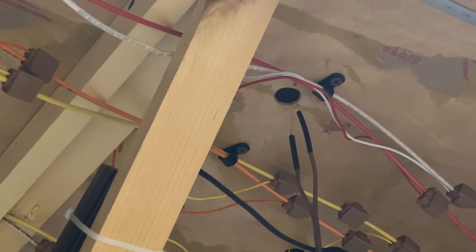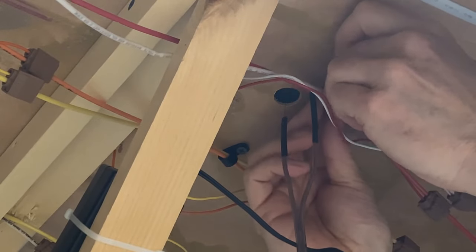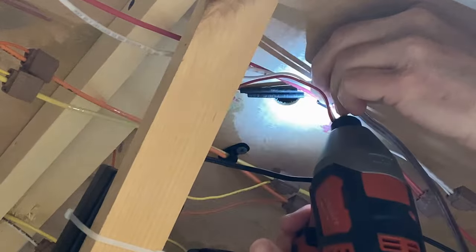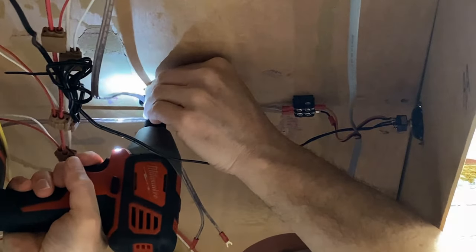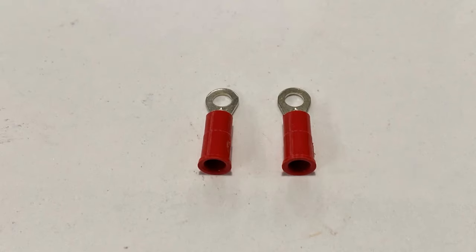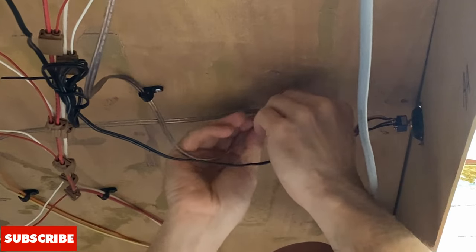For those people like myself who wouldn't know — the shrink tubing is just a cheap and easy method of insulating the wires that we're going to be attaching to the signal. One piece slides over the resistor and the second slides over the other wire that's going to feed the signal. We then attached the hanging wires to the layout using a clip to minimize the tension on the wire joints. Moving to the other end, we attached lug rings to the end of the wires so that they could easily be attached to the terminal block we were already using for the Tortoise control itself. You can find an affiliate link for these, as well as other items used in this installation, in the description.